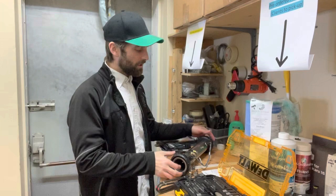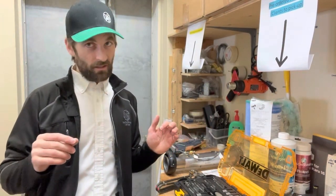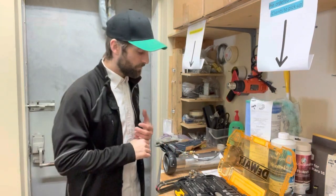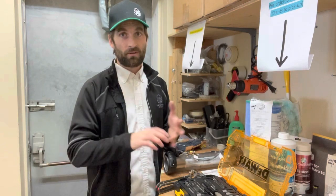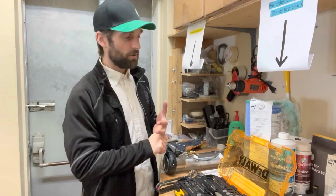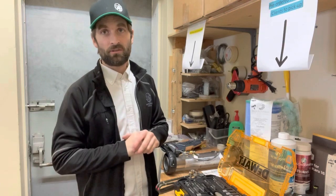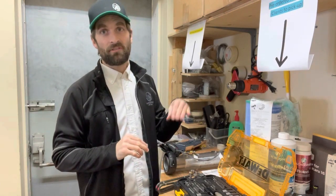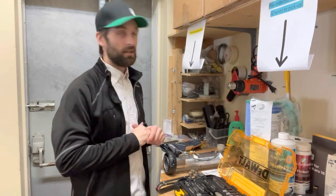The first thing you're going to want to do when doing anything in here: first and foremost, you're dealing with a lot of electricity — up to 240 volts. So either have an electrician friend or an electrician help you with this job. But if you're a bit of a DIYer, the number one thing you want to do is turn off the power at the GFI or even at the main panel in the home.